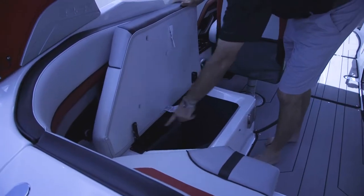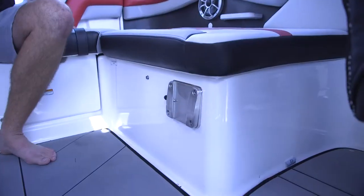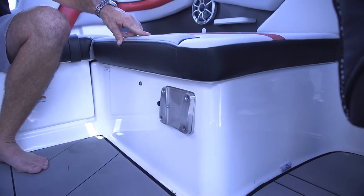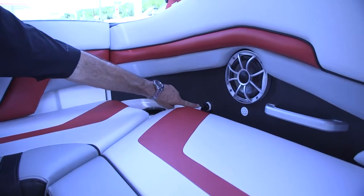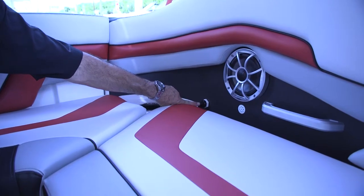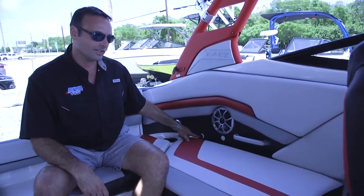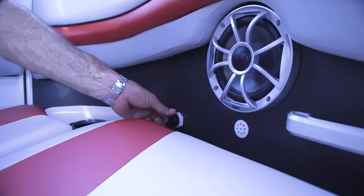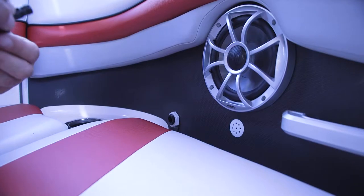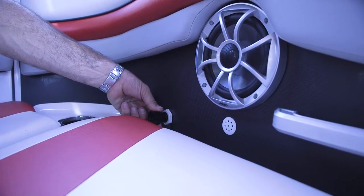Note that they're all hinged seats as well, so no misplacing the cushions. Also on the back of the boat is your table mount with a quick release, and the flush ports for both motors — one on each side. The flush port on each side works just like the personal watercraft: take the cap off, put on your garden hose quick connector, and it goes right in and locks.